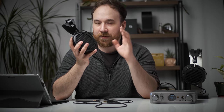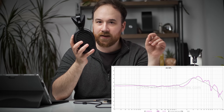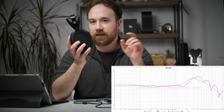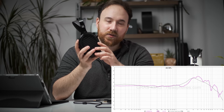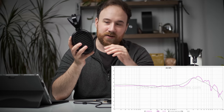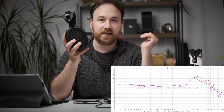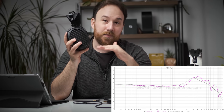Now let's talk about frequency response and tonality. The Hi-Fi Man Aria is actually the first headphone I've measured on our new standardized measurement rig from GRAS, so finally we can be more confident in the measurements than we used to be. I'm going to put some graphs up on the screen. The pink or purple line is the raw frequency response measurement of the Hi-Fi Man Aria, and the darker dotted line is the 2013 Harman target. Headphones don't actually measure flat, and so when people talk about flat and neutral, these concepts don't actually exist in reality for headphones — they're just relative to a compensation or a given target.